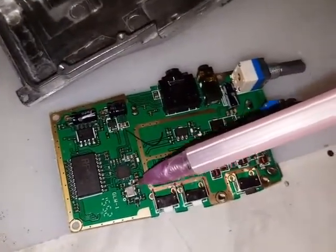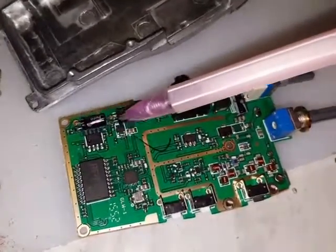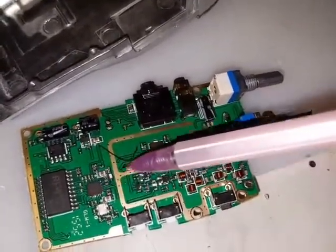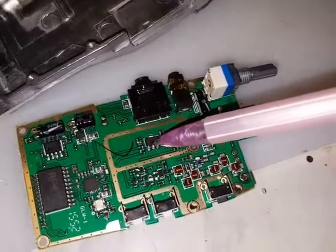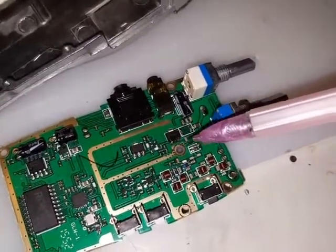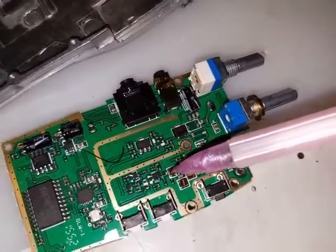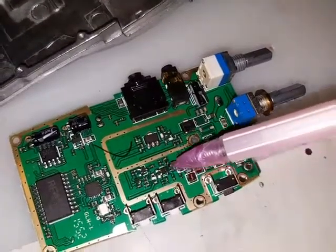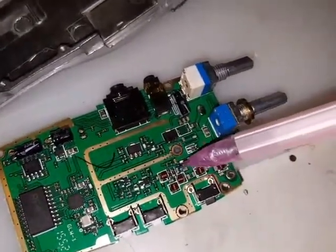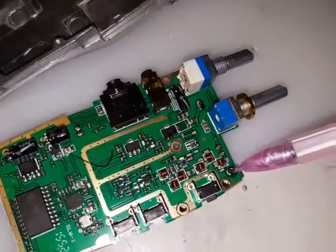This is the reference oscillator here. This is a little audio amplifier here with some local capacitors just to stiffen up the power supply. The RF comes out of the chip here, up through this path, into the driver stage, and this is the final stage. Then up around here there's a resistor-capacitor-inductor network, and down in here we've got some pin diodes. This is the front end of the receiver, a little pre-amplifier, and this works its way down onto the chip as well. This switches between RX and TX, and we've got some low-pass filtering here before it finally gets to the antenna socket.